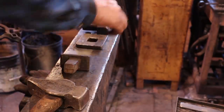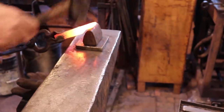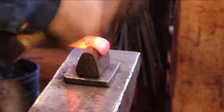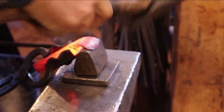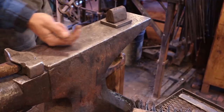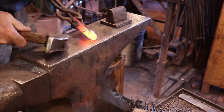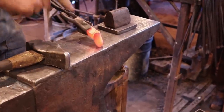I'm going to switch to a sharper fuller here, smaller diameter. I'm going to start rounding this up on here. That starts a very nice round so we don't end up with a kink in this. Remember you want to be able to hook your fingers under this pull to open the drawer, so you don't want to wrap this scroll so tight you can't do that. So we just want to gently scroll it up and keep it round.